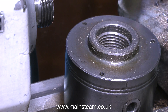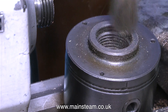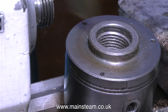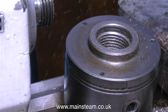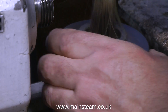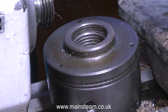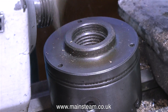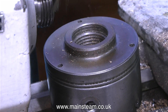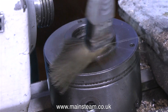Now that the three-jaw chuck has been removed from the headstock, you can clearly see how much swarf gets into the threads once it's been removed. This part of the clip shows accidentally brushing some swarf from the cross slide into the chuck. Normally the chuck wouldn't be cleaned at this point - threads would only be cleaned when about to refit the chuck to the headstock spindle.